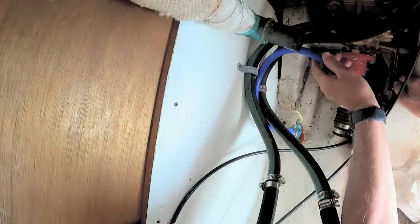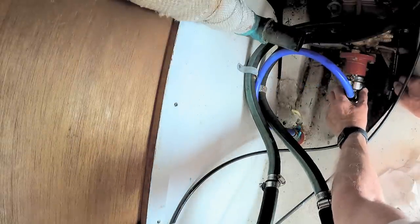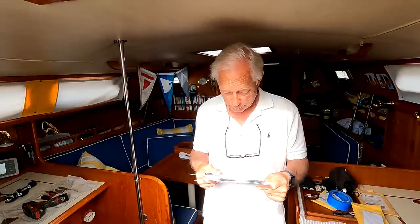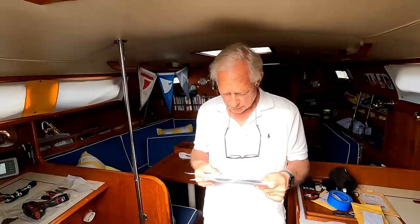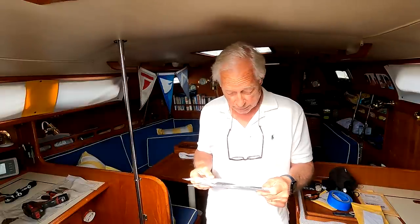It looks like the blue hose connected to the PSS shaft seal is putting pressure on the carbon stator and causing it to push away from the stainless steel rotor. Recommendation: either reroute the blue hose or remove it completely and plug the shaft seal vent. You have a sailboat, it's not required to run water or vent to the PSS shaft seal.